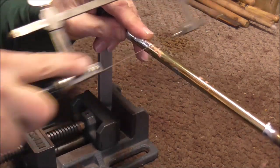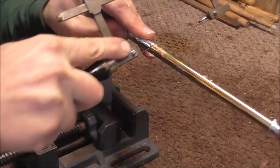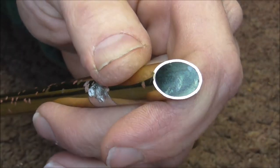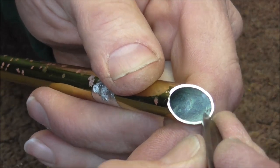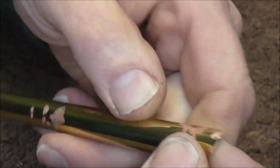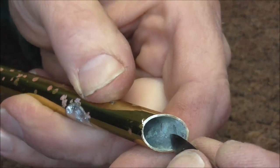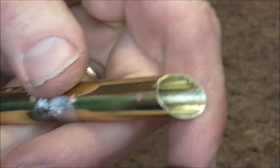I'm going to cut it diagonally so that you can get as good of a view of it as possible. There's a thin layer of lime deposits there, and then you can see that there is some bumpy stuff there and there. If you turn this around you can see that those bumps are underneath where the red rot is. Where the bumps are, that's where the zinc is coming out of the metal. I cleaned up the tube so that you can see it a little bit better.